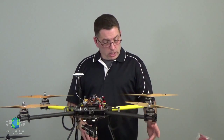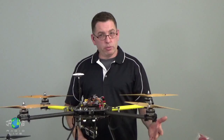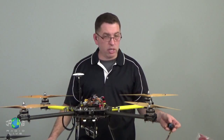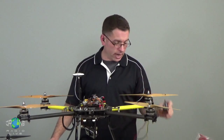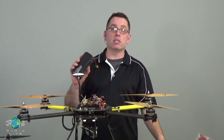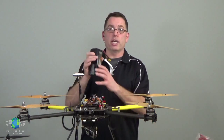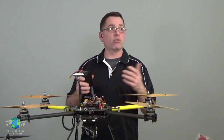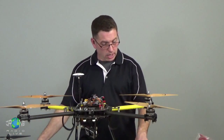Okay, now, as far as the motors go, we talked about 2 wires versus 3 wires. We said they're pretty much useless without the ESCs. Brushless motors were pretty innovative when they first came out because they're so light and they make so much power for how much they actually weigh. Just like the batteries, these things were a giant step forward because there's so much energy stored inside of this battery compared to nickel metal hydride or NiCads, which were the older generation packs.